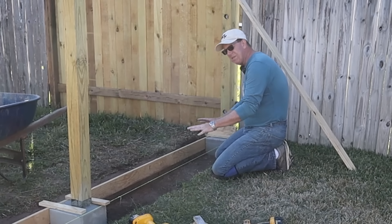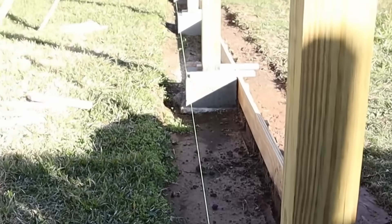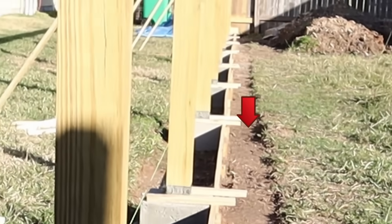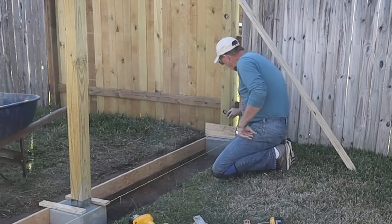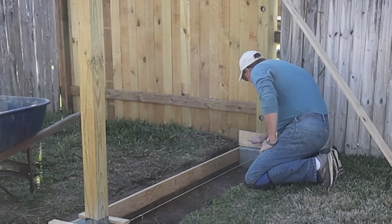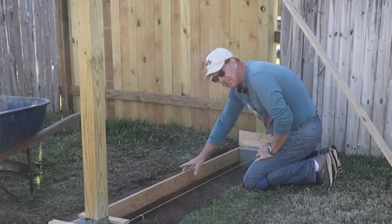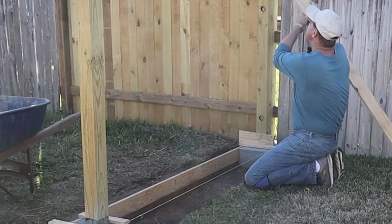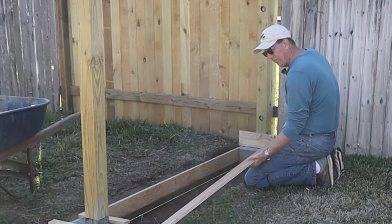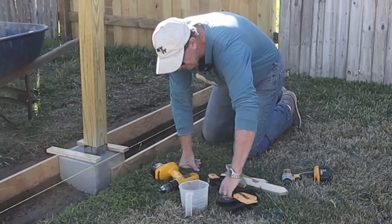Now it's time to get the other side of my form set. I've got a string line that starts here and goes all the way down to the end, running right next to the edge of the cement on each post. You can see I've already got this side set, backfilled with dirt and all ready. What I've done is put a block here and here and screwed it to this side, as close as I can get it on both ends, so the form can't possibly move if there's any wiggle. I've got my four-inch strip of plywood with the best side facing the form, and I'm going to set it in here and take a clamp to pull it tight.